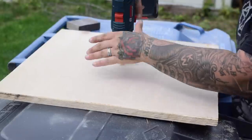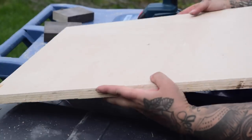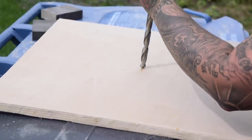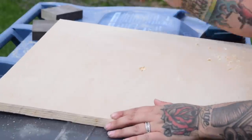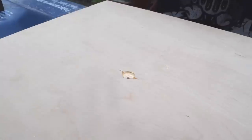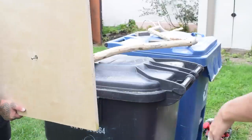You don't have to drill it in the middle — especially if you have an uneven stick or log, it's easy enough to put it in a corner. We wanted it in the middle so that bird droppings will land more consistently over it. We also need to drill a secondary, shallower hole with a bigger drill bit to create a small recess that fits a washer and the height of a screw head — so when you put both of those in, it won't bubble out and create a wobbly base; it will fit flush along the surface. We're using a washer to redistribute the weight so the screw doesn't rip through the wood.